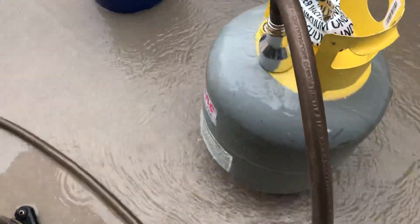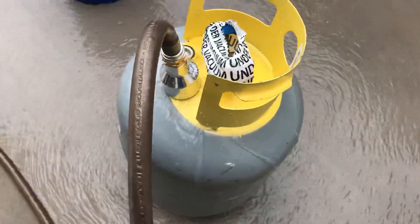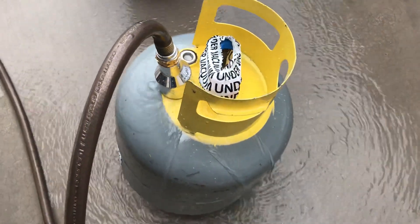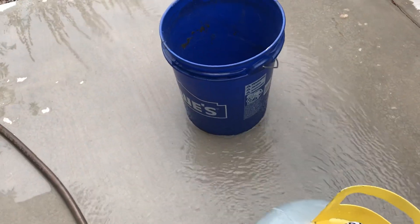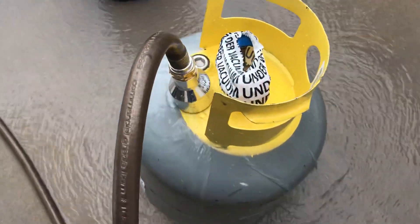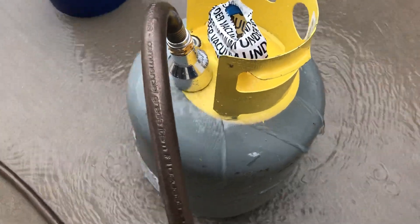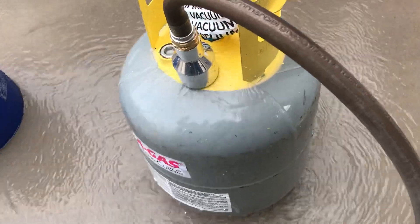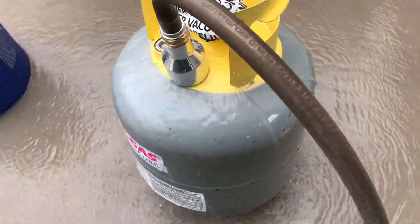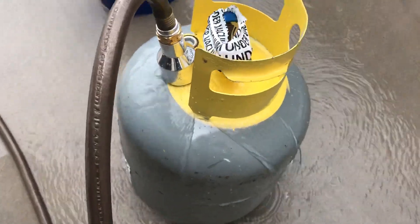And that's cooling down her 30-pound recovery cylinder. Here you can see water cascading all over the top of the 30-pound recovery cylinder. Now we know that on a 30-pounder, it will not fit in a five-gallon bucket like the 15 does. If you're on a large commercial job or you're recovering a lot of refrigerant out of a split system or a large built-up, the Cool Presser will actually do exactly what you need it to do — and that's cool down the cylinder in times when you don't have ice.